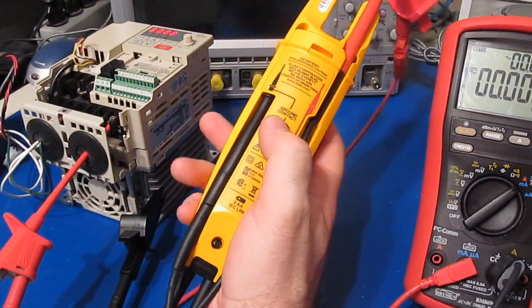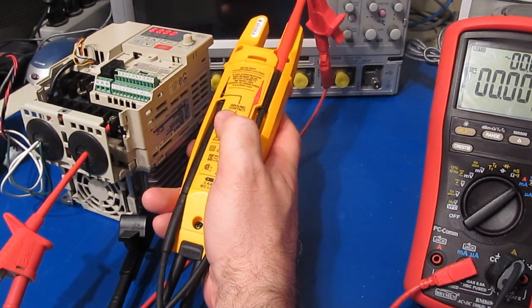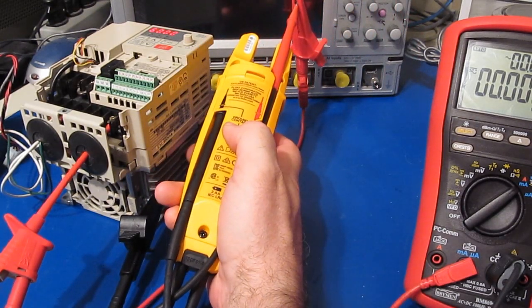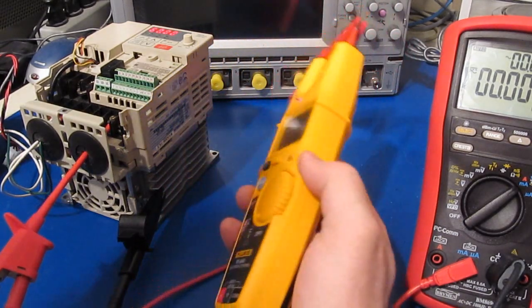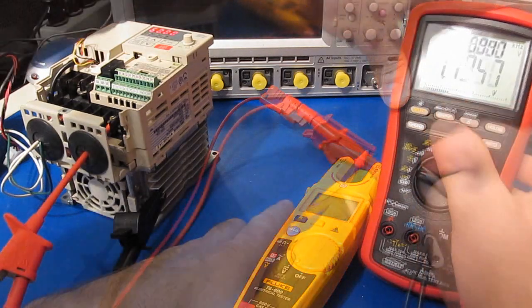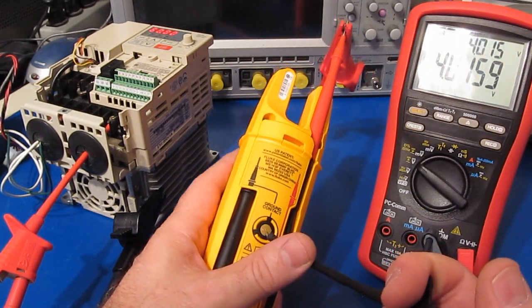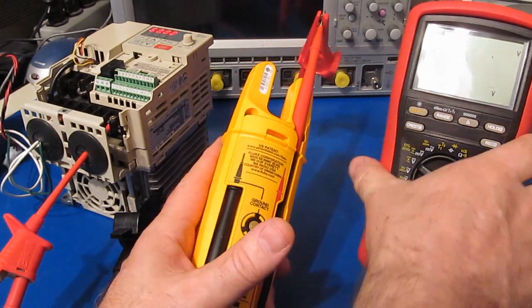What I'm going to do is just place my thumb on the button and touch the side of the VFD drive. Yeah, I can't really feel anything. Let me try it in the other modes. Yeah, I can't feel anything. Of course, if we take our clamp probe, place this into voltage, we'll place the Brymen in AC plus DC mode, and go ahead and touch our button now. So this is looking at the voltage from the output — and you can see we have about 115 volts or so.